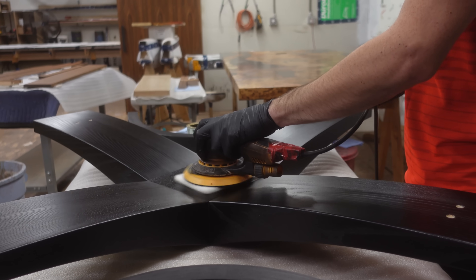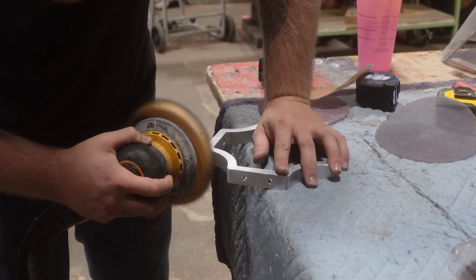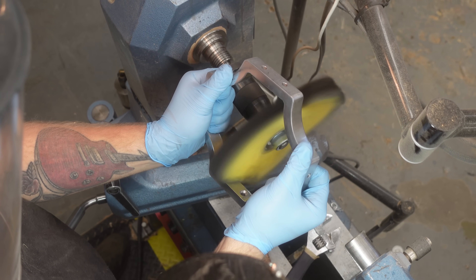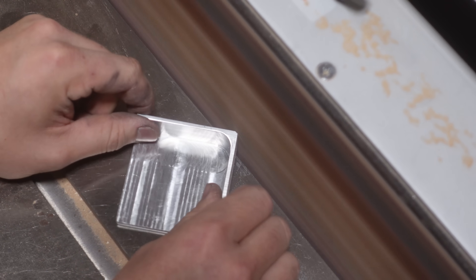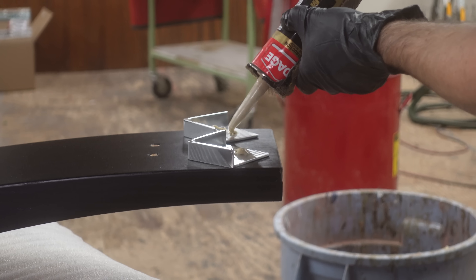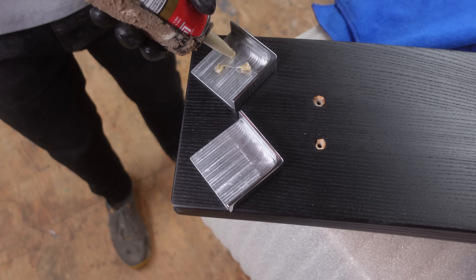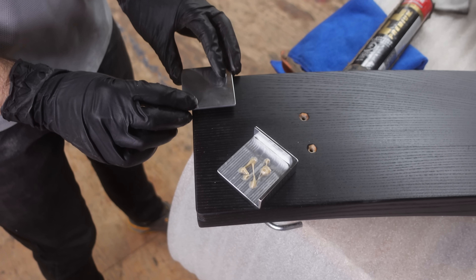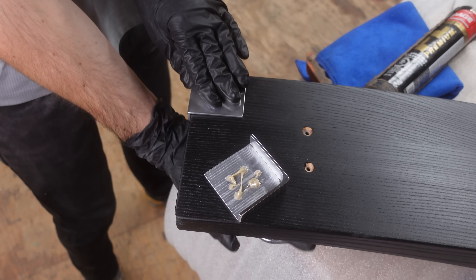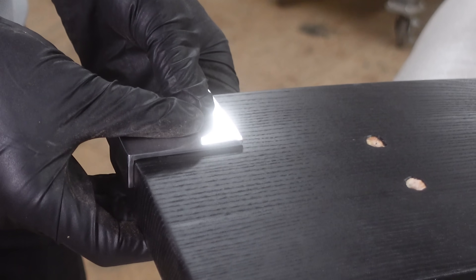Back to the metal detail — the client wanted a high gloss finish, almost like a chrome look. Although this is created from aluminum, we were able to sand it all the way up to a mirror finish to give that chrome appearance. We're doing the exact same thing for the feet details on this base, which go on every corner of the round table and help tie into other details in his space. To fasten these to the underside of the base we're using PL 400 — we didn't have enough thickness for fasteners, and countersinking them would have left them protruding into the floor. PL 400 in our experience is an adhesive that's going to hold for a very long time, and something like this isn't going to get a lot of force pulling on it either.